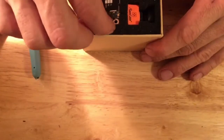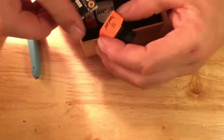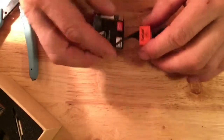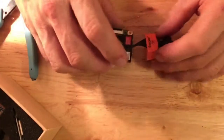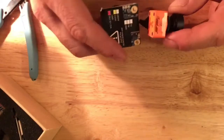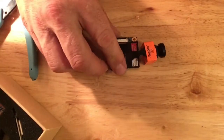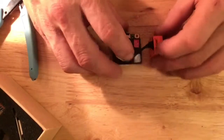I've actually had some experience — I have this mounted in another one of my quads and it works really well. I like it. The only issue is if I plug it into the 5 volt and the battery gets really low, it'll drop a little below 5 volts and it'll shut off mid-flight. So this time I'm just going to put a capacitor in to help smooth out the battery signal and connect it directly onto the battery since it'll handle the battery voltage. I'm just running 4S.